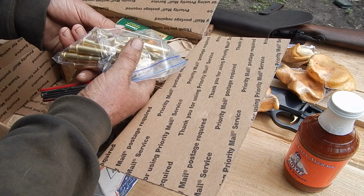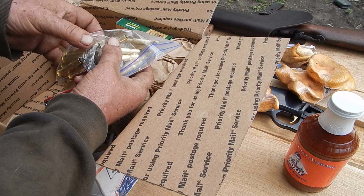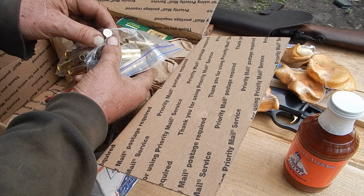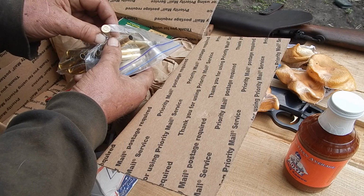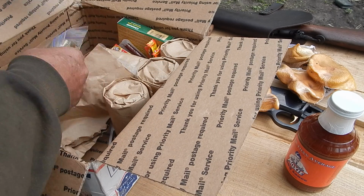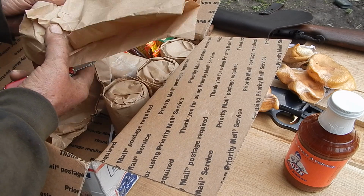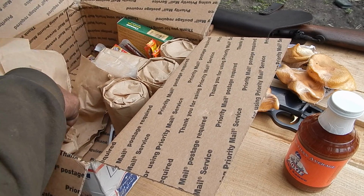But it was funny when I was reloading some of that brass, I tried one of those Hornady ones, and there's something weird about the primer pocket on them. I'm going to have to ream the primer pockets out because I actually couldn't get a regular large rifle primer to go in them. I didn't try forcing them, but it was too tight. I mean, I couldn't get one in. I don't know if they're crimping them in, which might be because I've had those Hornady primers back out.